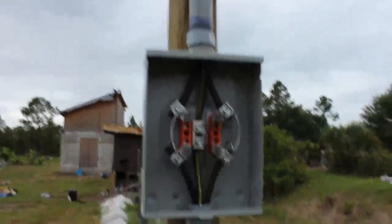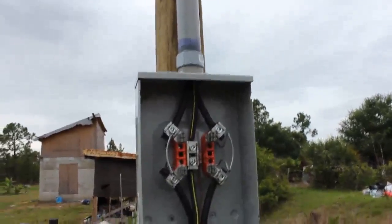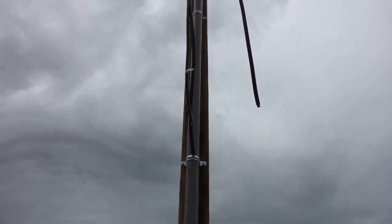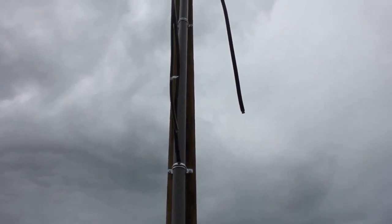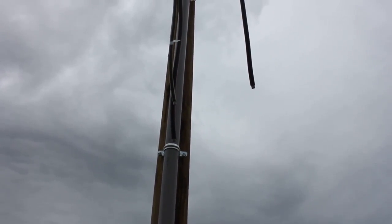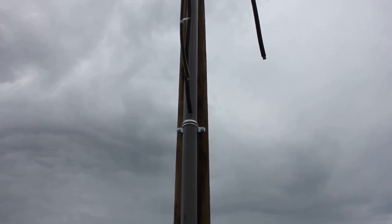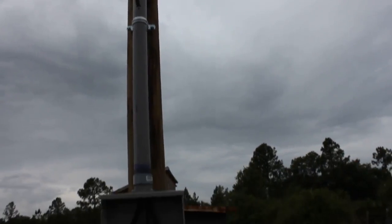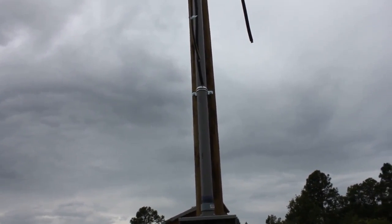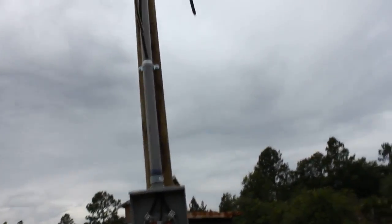The pole was $60 from a lumber yard in Immokalee. You need two-inch PVC conduit and 4/0 aluminum cable, which according to the NEC is what you need. I got the cable from Lowe's — Home Depot does not carry aluminum cable, only copper, and copper is much more expensive. Go to Lowe's and get it for $1.89 a foot for all three conductors, not per single cable. An electrical supply house wanted to charge me $4 per foot for a single cable. I got a 20-foot cable for about $30 something dollars.